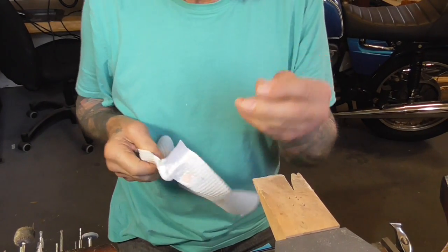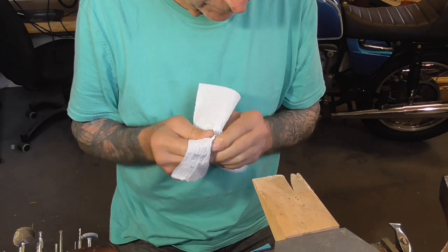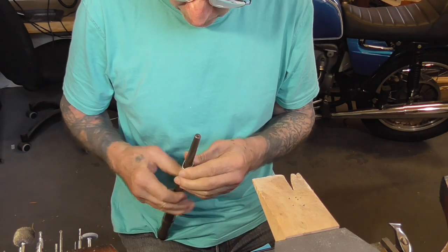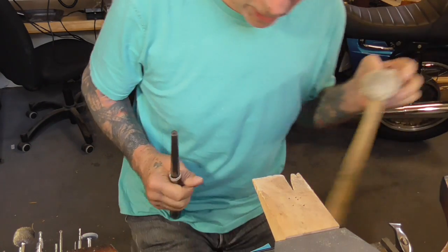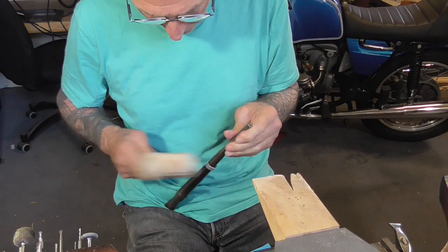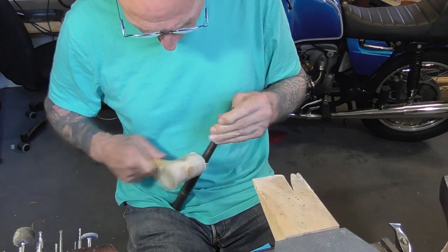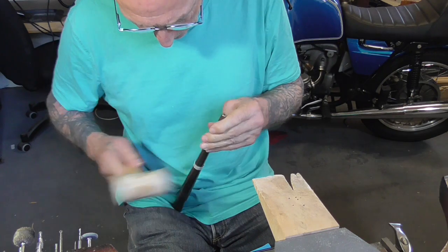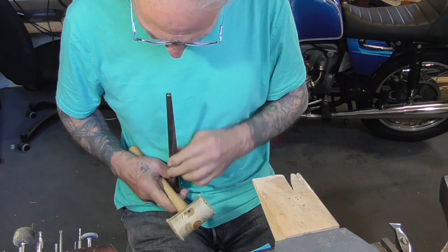Pickle it, then we'll round it up and sand it back. Come out of the pickle, rinse it, dry it — always dry it. Then put it on your ring mandrel, just push it down as far as you can, use your rawhide hammer, flip it over, and make it nice and round.